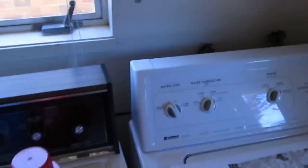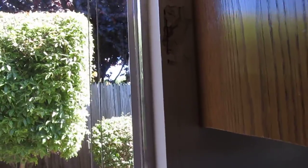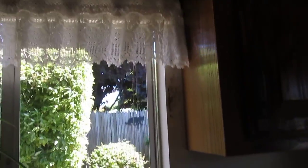I think we're all set, and we need to put the screws in here. Inside the house, there are signs of water damage right inside the window — that's the worst of it. We want to scrape some of this out and make sure there isn't any damage to the framing. If it basically looks like cosmetic damage, we'll open up just the stuff here so we don't have to remove the curtain or the cabinet. You're going to need some plastic to protect the washer and dryer and catch the chips. We'll make sure there's no rot, then take a little 20-minute mud and spackle it back up. Their painter will take care of the painting, so this is really more of a verification check.